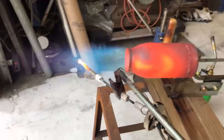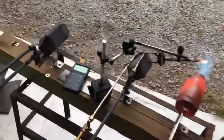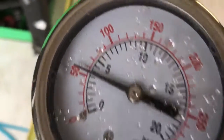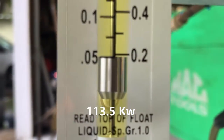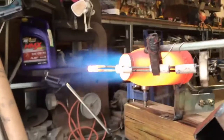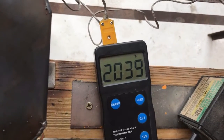I've had it turned down a little bit here just to see what I can do, so I'm just tinkering around with it. At no point could I get it back up to that temperature again — I think I topped out at about 2130 degrees or so. This is with max air input, and we're at about 0.05 gallon per minute. Not a bad combustion chamber, but this nozzle isn't doing it any justice.